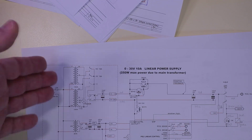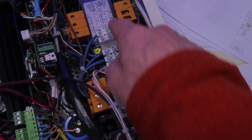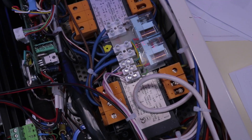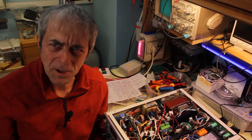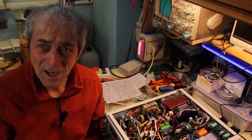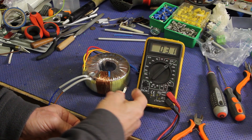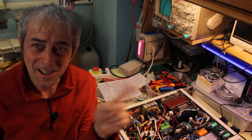By putting two transformers together in series I was able to double the power and reduce the power dissipated by the transistor depending on the regulated voltage — the two relays switch accordingly. Of course, if you don't have transformers you can just buy one with the taps and coils you need, or buy a standard toroidal transformer and add coils, which is pretty simple — as shown in my previous video linked in the description.